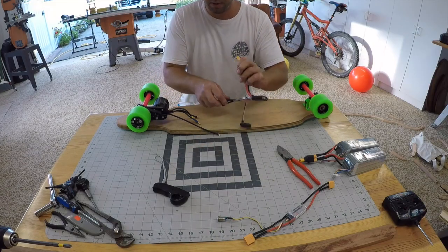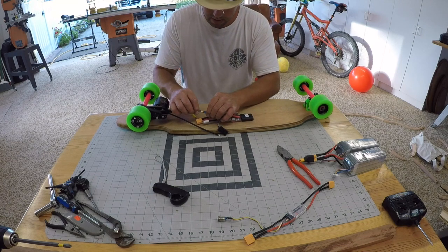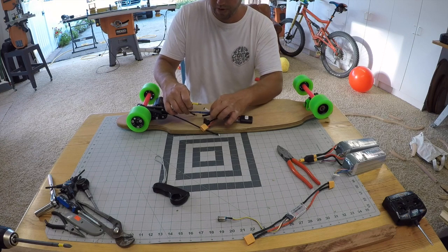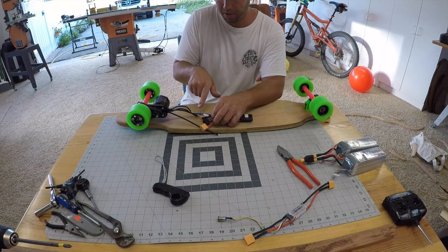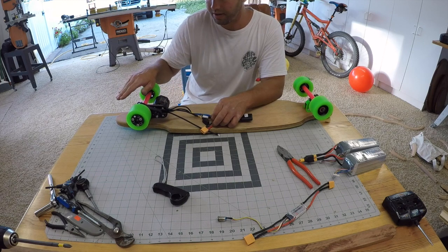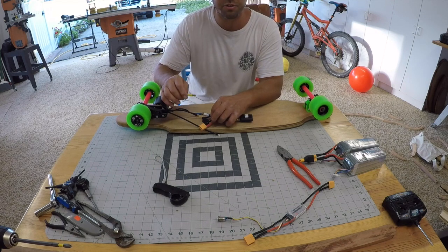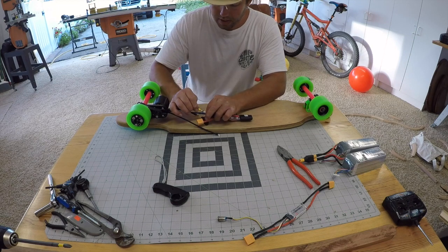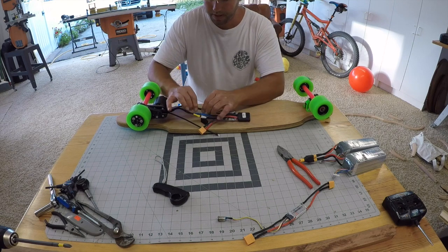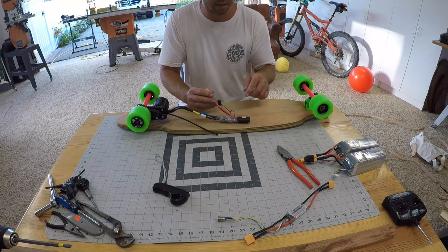First thing I want to go ahead and do is plug in the VESC. Here I've just color coordinated the correct connections. Here I guess polarity does not matter, it's just going to spin your motor in one direction or the other direction. So here you just plug and play until you get the right direction that you are looking for at home. So my yellow is the white, my blue is the blue masking tape, the black is the black. There, I've got my RC receiver plugged in there.